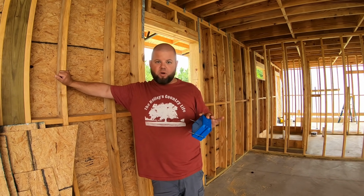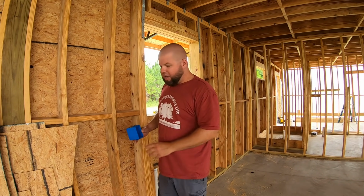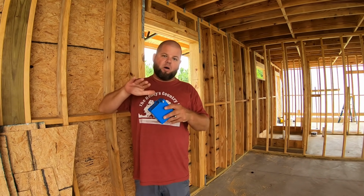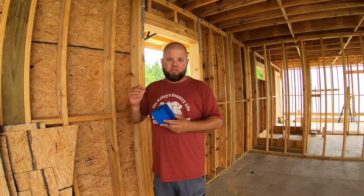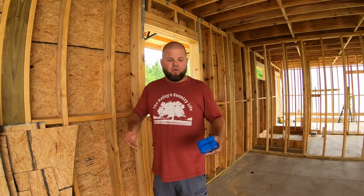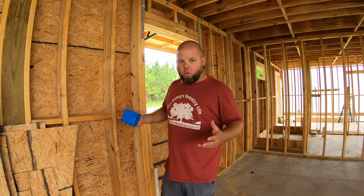So with that said, I think I have finally settled on a number. There are so many different numbers you can go with, but I'm not going to go with the standard height numbers. 42 inches to the bottom of the plate for the walls. This will get me under the blocking. It will also leave me some sheetrock above the top for the sheetrockers to tape a seam. I know a lot of people say, hey, you should mount this right at the edge of a sheet so they notch a sheet and don't have to cut a full gap. Well, in my mind, they're already going to cut full gaps on outlets that are near the floor. Does it really matter if you cut a full gap on a couple more wall switches?